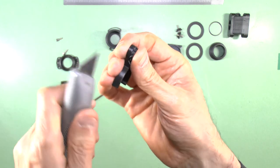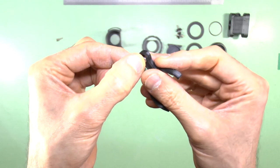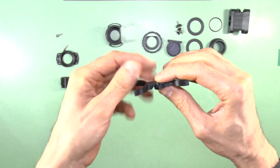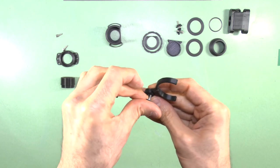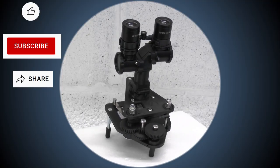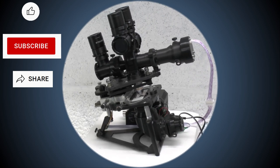To build the cap spacer, remove the 3D printing support from the nut arm, force-fit an M3 nut into the cavity, then fix the two arms together with an M3 thumb screw as described in previous videos. Your ocular head assemblies are now complete and ready to use. In other videos, I'll give dedicated instruction on methods and software for image capture using the various adapters described here. The trinocular camera port will also be described in a separate video.